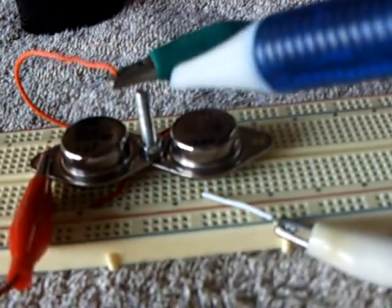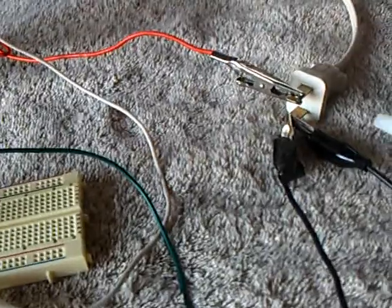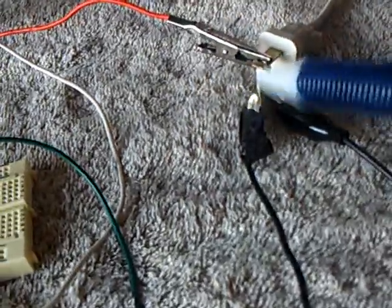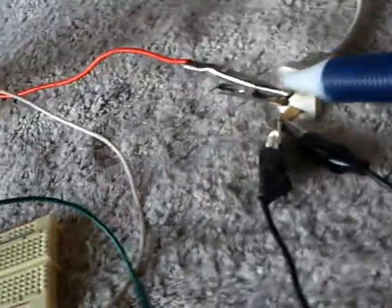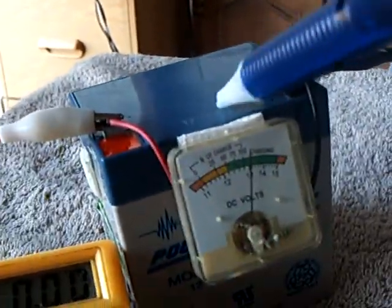This is the little trigger right here — when you tap it to a power source it starts the whole thing oscillating and runs the CFLs. I also played with the earth ground today to see if we could eliminate the shocking. I was getting badly shocked and Aroma's got shocked pretty badly too. I found that if you connect the earth ground to the ground part of the circuit and keep it away from the high voltage source, it eliminates that problem. Having it on the high voltage side energizes the whole circuit.